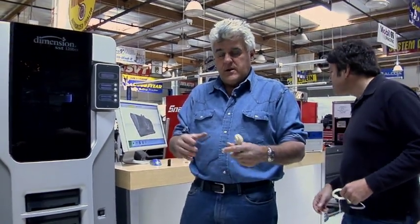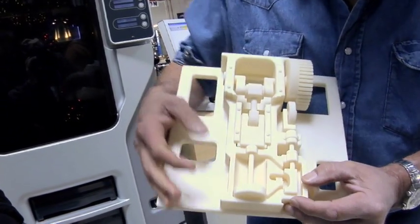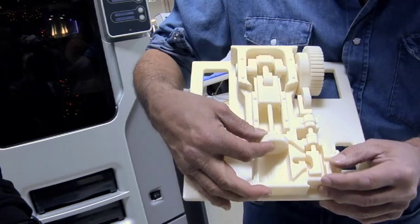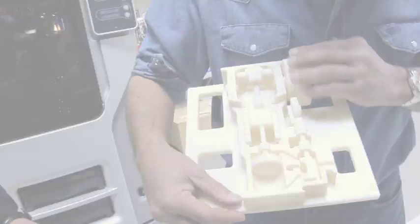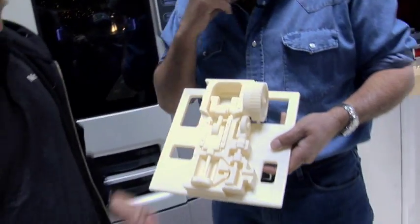I've complained over the years — we needed some gears cut for a Duesenberg about ten years ago. I needed gears that were hypoid and helical. Every gear cutter was either out of business or had sold their tooling to China, Korea, or India. You had to send Duesenberg parts to India to get them made. Here's an actual whole steam engine they made. You know the D-valve I showed you? There it is — it slides back and forward. The way a steam engine works: it slides, lets steam in, pushes the piston down, and the D-valve moves up and back. This entire thing was made as a complete assembly with no assembly work afterwards — it's all made in one shot.